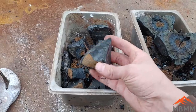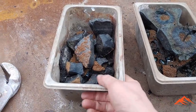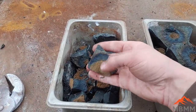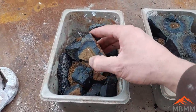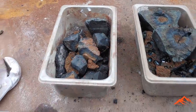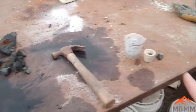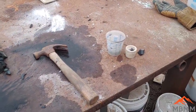And that'll tell us, yeah, you've got all the precious metals out at a 1-to-1 ratio, or boy, there's still a bunch left in there in this matte phase that we made, and you need a higher volume of flux, like a 2 or 3-to-1 ratio to get all your precious metals. So we'll smelt this one down and see if we can get any more precious metals out, and we'll start cupelling this and figure out how much gold we recovered from our total